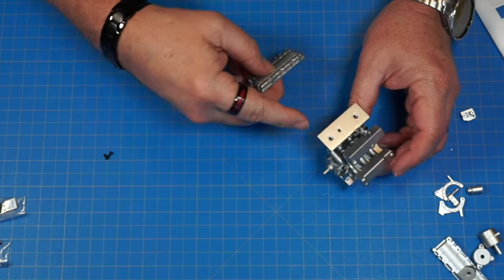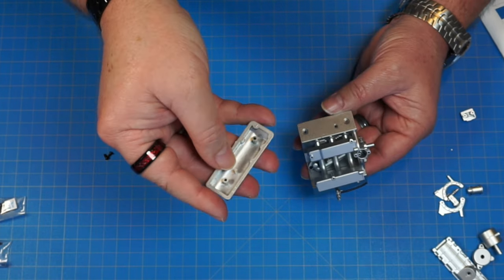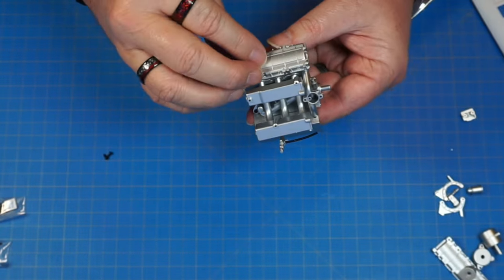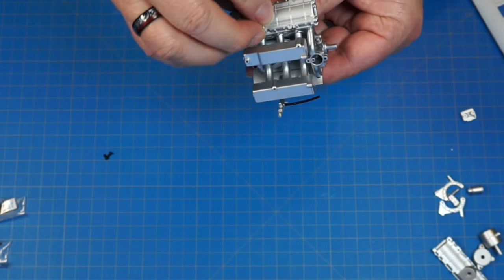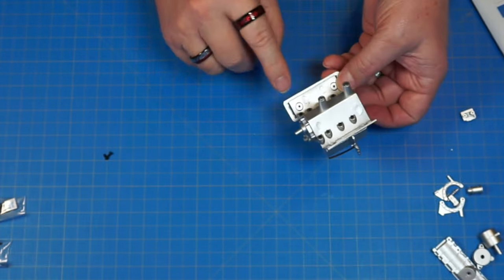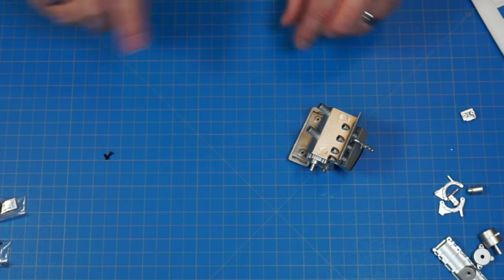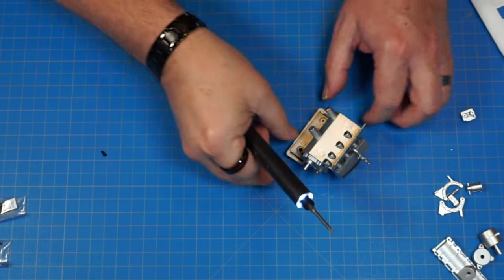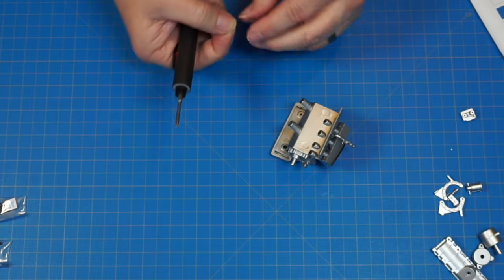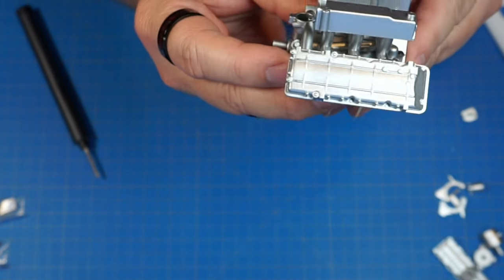All right, guys, so 21A is going to go here on this side, spin it around. It's going to go on this side here. It really goes one way because we have a little guide pin right here that goes into this hole here. So it's really the only way it's going to go. You want to just get that guide pin into that hole and lower the whole thing down on there, just like that. And now we're going to flip it over and we're going to screw this in from the other side with the two FP screws. So I'm going to put it just like this and we're going to screw it with the two FP screws. I'll put that up in my hand here and hold it a little bit better. Nice and tight like that. I'll put the other screw in. There we are. Going to look just like that and like that from the other side.